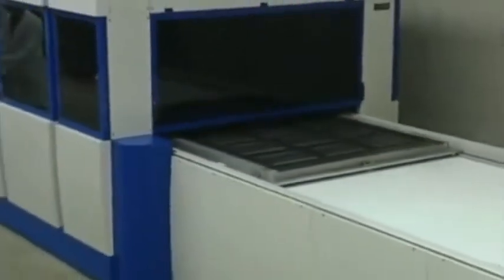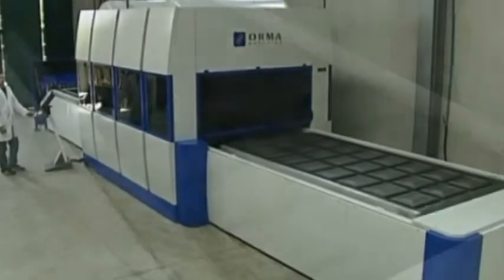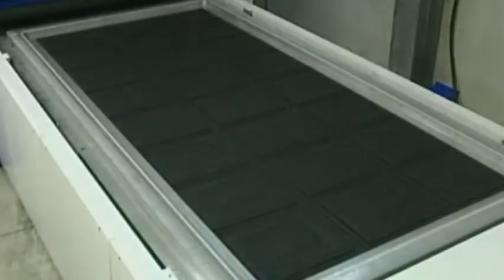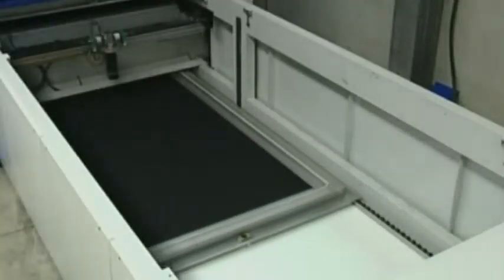When the tray has come out of the press, the panels are unloaded. Here again, this operation can be carried out by hand or automatically. When the panels have been lifted off the tray, the platform lowers it to the height of the lower guides, where it is moved to the side and kept on hold, awaiting the next cycle.